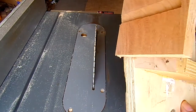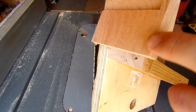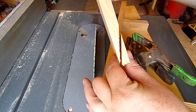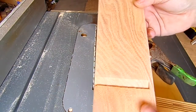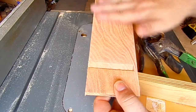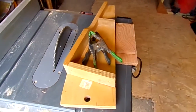As you notice, it didn't cut this all the way off — my headstock blanks are a little bit wider than what my table saw blade will raise, but that's really easy to fix. I can come along and just trim this off when I'm ready to shape it. You can kind of see it there a little bit better now. Once you've got this blank we'll go over to the bench — that's basically all there is to it. You run the neck through and the headstock through, and then other than shaping the headstock you're ready to go.